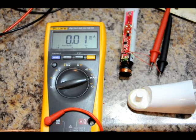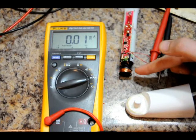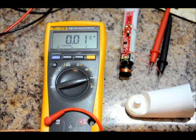I've been tinkering a lot more recently with wireless power transfer. I've got a few PCBs on the way — can't wait to experiment with them. I've made a customization PCB for a transmitter that will allow me to really tinker and come up with interesting new ways of transferring power from A to B. Unfortunately, since I can't get into the transmitter, I can't see how efficient the circuit is. The gauge of wire on the receiver is very, very thin, and I didn't expect to get a ton of power — I expected a little bit more than 100 milliamps, but what can you do?